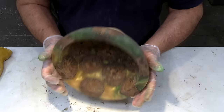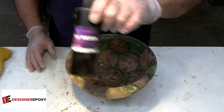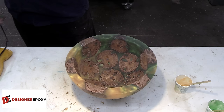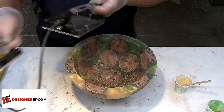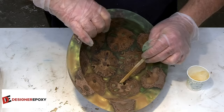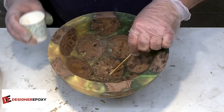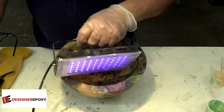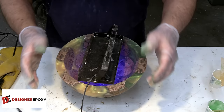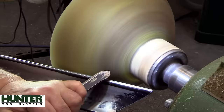A little surprise seeing some fuzz — the stabilizing resin was getting a little old, so that could be part of the reason. We've also got voids on the outside to fill. We're going to use UV resin from Designer Epoxy, and I've already mixed up some green and some gold with a little hypershift in them. To cure this resin we're going to be using a UV light — I have two of them to speed up the process. Let's fill some voids, get some UV light on these, then get it back on the lathe for a final trimming and sanding.